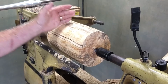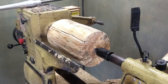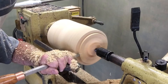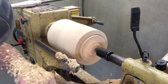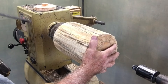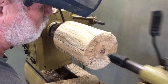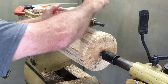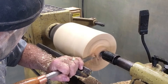I might actually take a piece off as a possible lid. I have this piece mounted between centers — no chuck on there at the moment. I'll usually put a face plate on it, but recently I've been trying something a little different. I mounted it between centers, cut a tenon on it, flipped it around, and I'm going to add a glue-on block to add a tenon to it afterwards. First try at that, so let's hope it goes well.